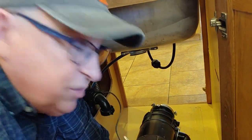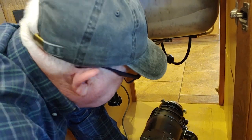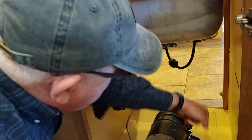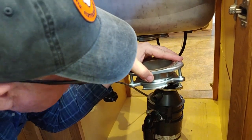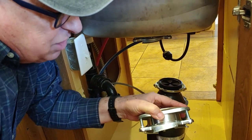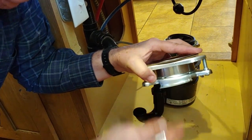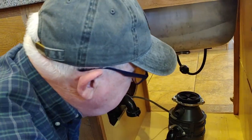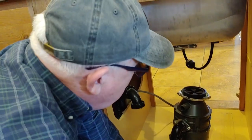Let's get this installed. First, we tucked the power cord off to the side to minimize interference and removed the liner from the bottom since it tends to catch on everything and wad up — removing irritations and distractions. We're going to orient the unit roughly in position we need, then raise it to the clamp fixture at the sink outlet above. The three ramps climb to the right, so we put the affixment ring on and rotate it to start climbing and clamping tighter. We'll leave it loose enough to adjust alignment with the discharge tube and P-trap. These are fairly heavy — if you have someone to help lift it, that's a big help until the ring grabs on.